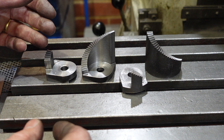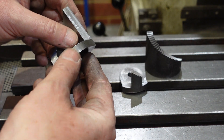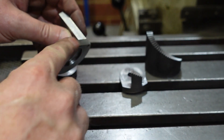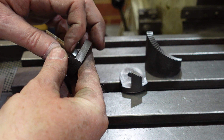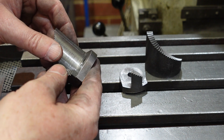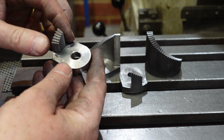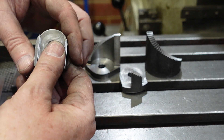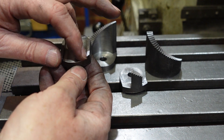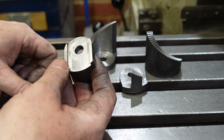Here are the four finished parts. On the large parts I've put an R16 radius in there and joined it up, and just flattened off the ramp to give it a square corner. On the small parts I've done something similar, put two flats on there, radiused the front so it'll actually sit inside there, and put a slot in there that will take a standard strap clamp. I'm going to use a strap clamp to hold these things down.